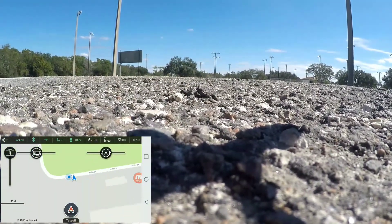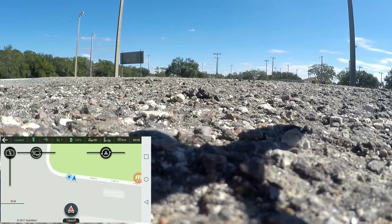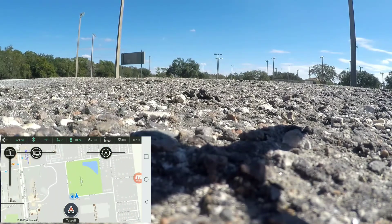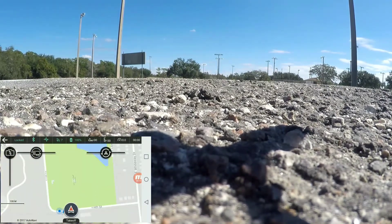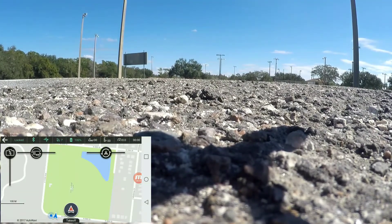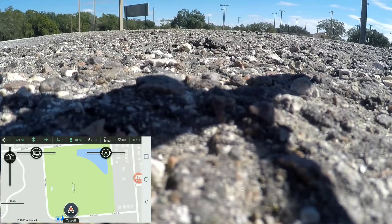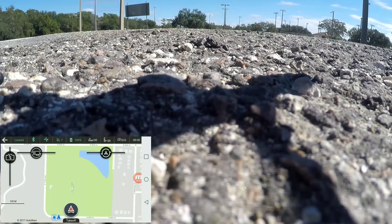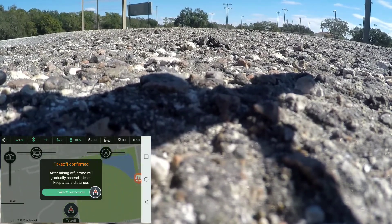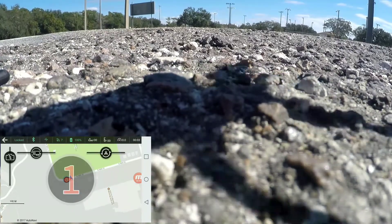All right, guys. We're going to try to do another tutorial with the modified G-Box here. I've started the screen recording. Everything seems to be working just fine. I'm turning my body — it understands the compass bearing. I'm going to pinch the screen to bring this back out a little bit and drag it with my finger. We're going to zoom in just a tad bit. We have a good waypoints map. I'm going to try to stay within the green here, make sure my camera is pointed up. Seven satellites is more than plenty — though today is a crummy day for satellites. This is with the modified G-Box. I'm going to go ahead and hit take off. We're going to see if we can do some waypoints with this antenna modification done.